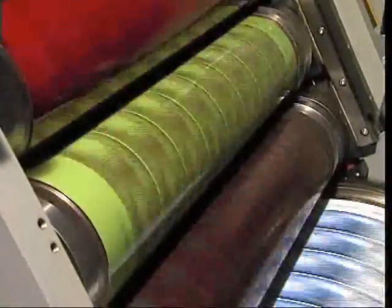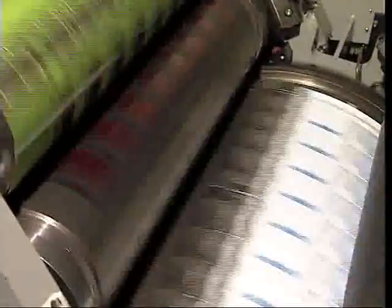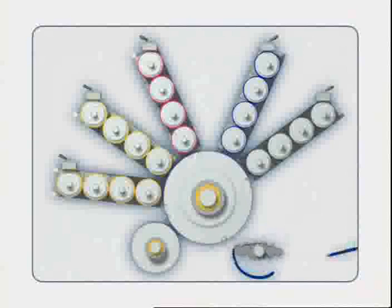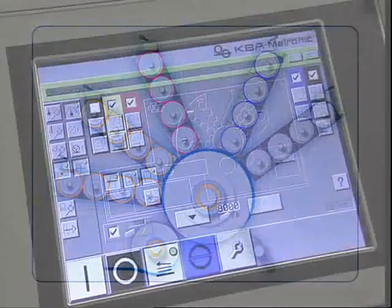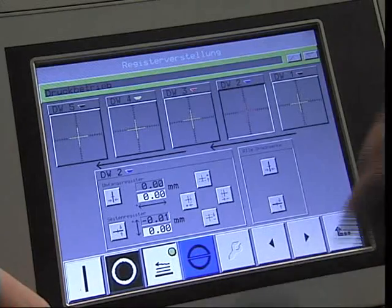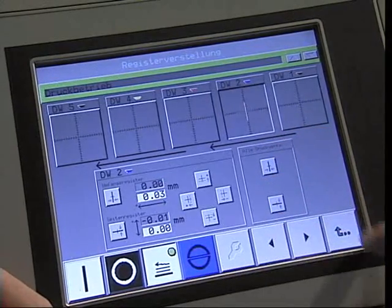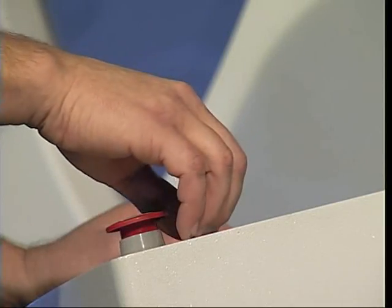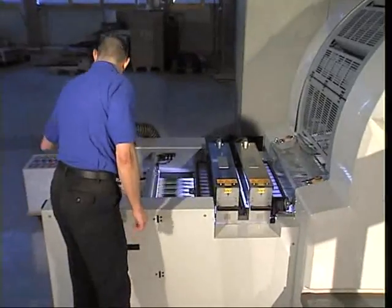A newly developed pneumatic plate clamp ensures plate feed in keeping with the register. Setting the lateral and diagonal register, as is normal with conventional sheet-fed offset machines, is not required. At the same time, the extremely short refitting times for the Genius 52 UV enable the printers to change jobs frequently in the course of a day, and even very small print runs of only a few hundred sheets can be produced very economically.